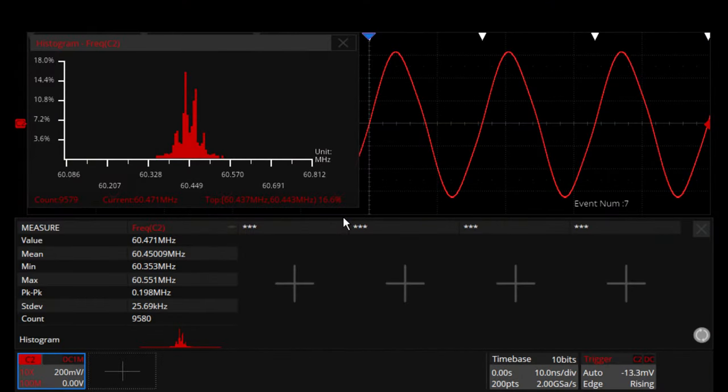Remark: during this project, I also used my oscilloscope for double verification, and something interesting was discovered. At the same spot, TP1025, with the same probe, the measured frequency matched. But the waveform and histogram are not so clean. Look at these two spikes — there should be one solid peak, but no. I don't know if it's something in my transceiver, or maybe my oscilloscope, probe, or something else. If you have some ideas, welcome to the comments. Anyway, the transceiver is working — working well and stable.